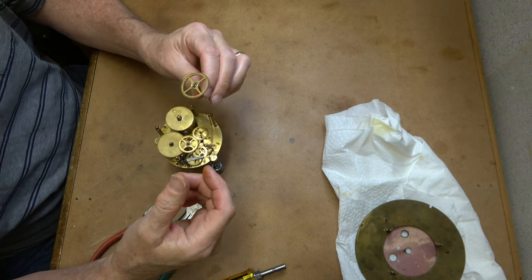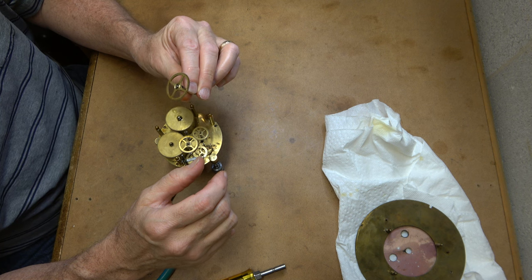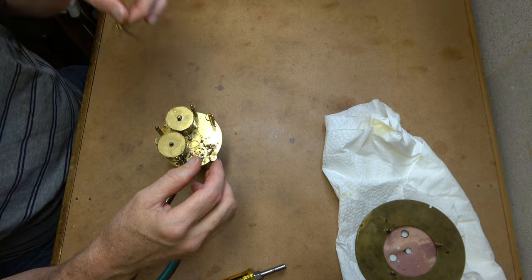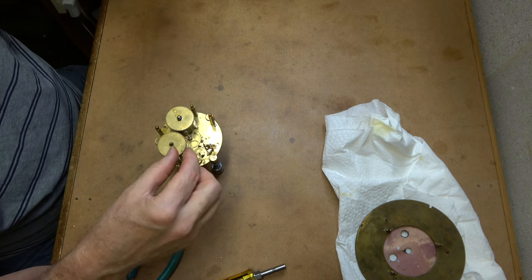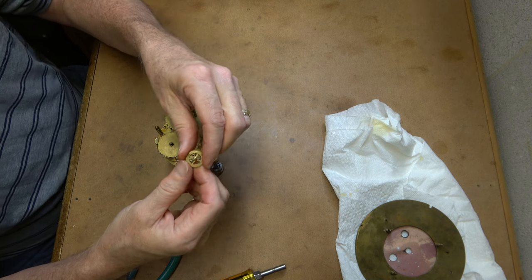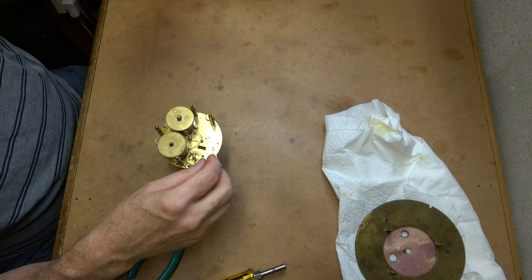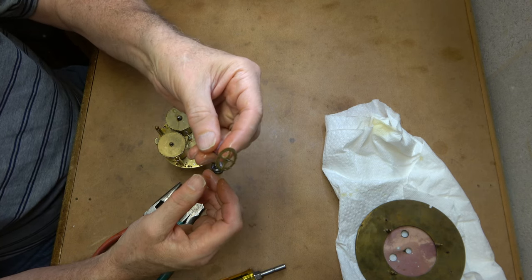The second wheel. Don't need to really mark these because the second wheel in French movements is usually larger. If the barrels haven't been marked, I might want to mark those. Take that wheel out. The second wheel, the strike train. There's your strike shutoff lever there. This hammer here, hammer lever. There's a shutoff wheel which contains the extension for the gathering pallet. There's a fly, warning wheel. There's your pinwheel here, where these actually lift the hammer as it spins around.